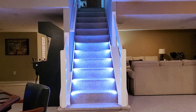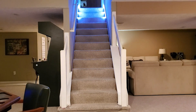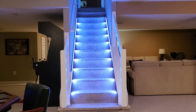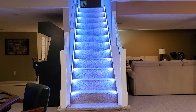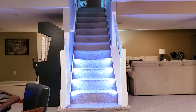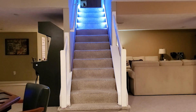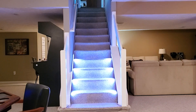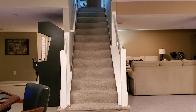I've got motion sensors at the top and the bottom. It's able to detect which direction by which motion sensor fires first. They turn the lights off when the other motion detector is triggered. If you trigger them from the bottom and don't continue up the stairs, eventually these lights will turn themselves off after about 15 seconds. All of that is handled through Home Assistant and Home Assistant Automation, which we'll talk about a little bit at the end.